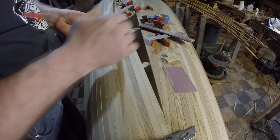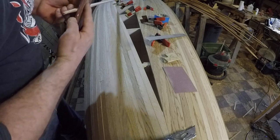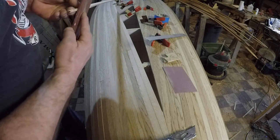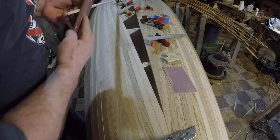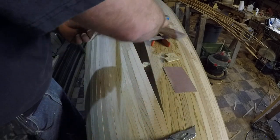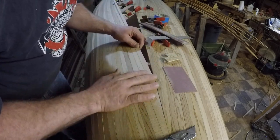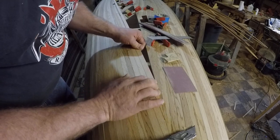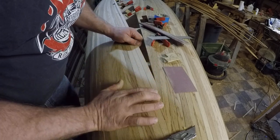Once it's getting fairly close it looks like I need to undercut that a little bit. At this point the top edge is not as tight as the bottom, so I'm going to use my sanding block. I'd rather have it be a little loose on the bottom and have the visible side be nice and tight, but given that this is a canoe you'll actually be looking at the inside as much as the outside, so I want it to fit pretty well.